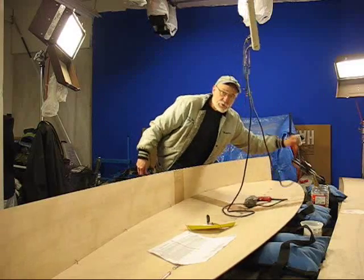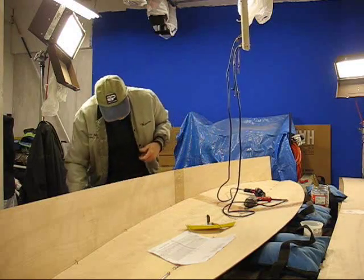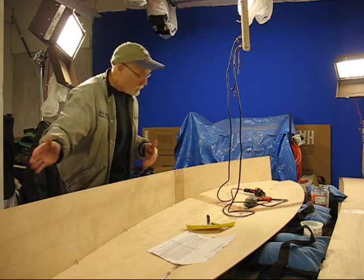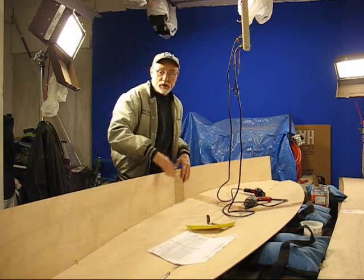I've got another drill set up for the quarter-inch bolts, so I'll walk this along. I usually start at the stern and work my way along to the bow. There are some spots down here where it slides in, so I know the end will be off — it'll go either one way or the other — and then I will cut it, measure it, cut it trim, then do the opposite on the other side and get that panel wired in.